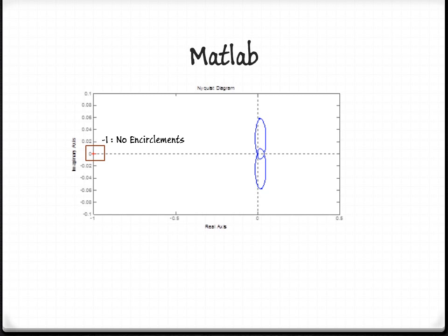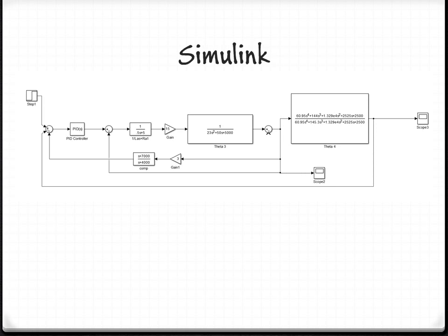In the Simulink block diagram, there are 3 feedback loops. The first loop, marked in orange, is a feedback loop for the angular velocity of the upper arm. The second feedback loop, marked in blue, consists of a gain and a compensator. The compensator is necessary because it accounts for the zero and double pole of the theta 2 over theta 1 transfer function. The third feedback loop allows us to compare the desired angular velocity with the output velocity. It achieves the goal of the system.